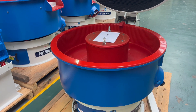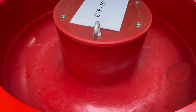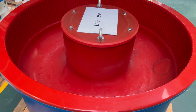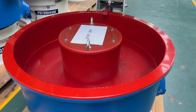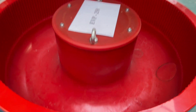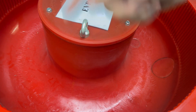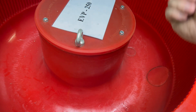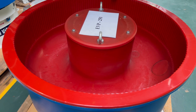The circular bowl is the original design, designed so that small to medium parts can be put in there. You can go to larger parts — that's just a 250 litre, could go up to 800 or more litres if you wish. What that machine will do is the parts and the media move within the chamber: it oscillates within the chamber and rotates around the bowl, giving a corkscrew direction through the process and thus keeping parts away from each other if they are of a similar drag factor.